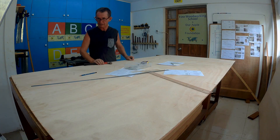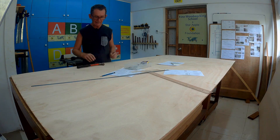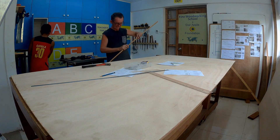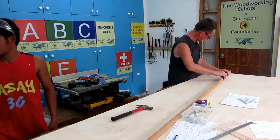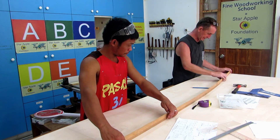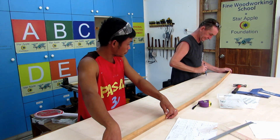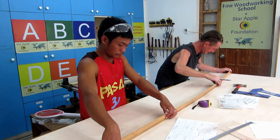This sailing one has a big high-up sail — I'm not sure what it's called, maybe a gunter or something like that. The thing is fairly high; in the drawing it says it's four meters high on this little boat. Myself and Rex are going to draw the line here again. Don't push it in anywhere between the nails — just push them in where the nails are. Rex, don't touch the top of it. When you think you've got a fair curve, I might have to give it a little push. They're touching all the nails.